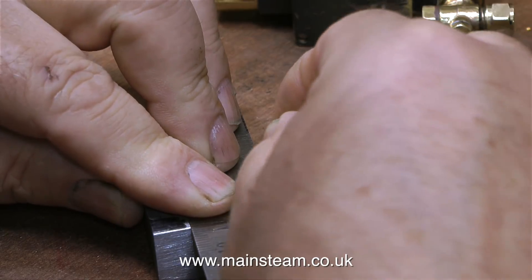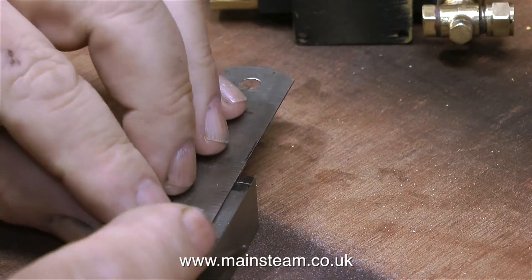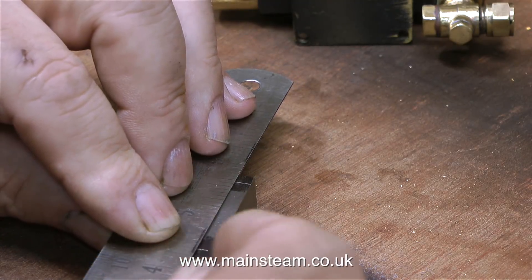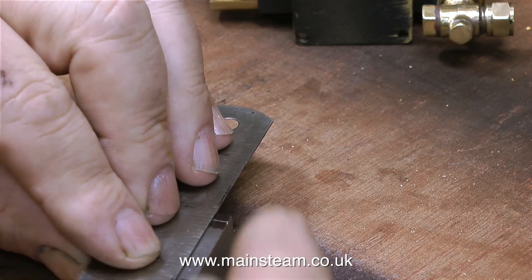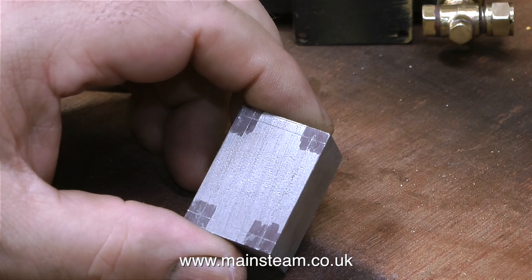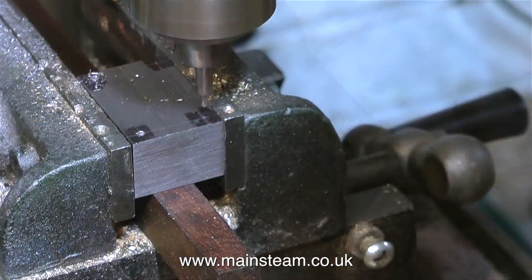In this clip I'm scribing lines between the marked points, just to make sure that they are in the correct place — and they seem to be. It's always a good idea to do this, just to verify that all the markings are fully in line with each other. Because the other alternative is to drill the holes in the wrong place, and you don't want to do that. From time to time I still drill holes in the wrong place — I'm not perfect at this, not by a long way. But with years of experience, my eyes are reasonably well calibrated.